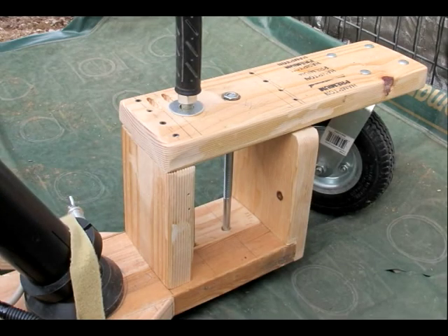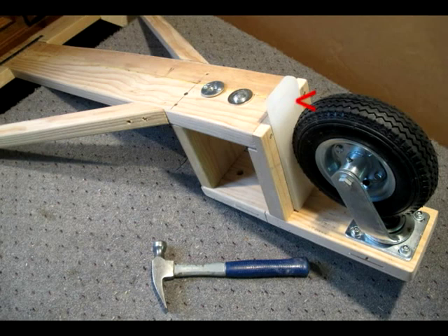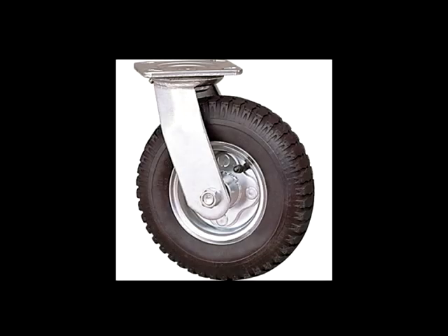The height of the front wheel support is determined in the same way as the rear wheels. A half-inch spacer block used when attaching the front caster wheel provides the necessary clearance for the wheel to operate freely. If you intend on operating the buggy on a concrete surface, hard rubber tires of five inches or more can be used. But ten-inch pneumatic tires provide the smoothest ride and operate better over rough terrain.